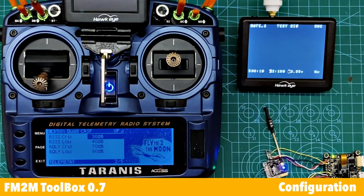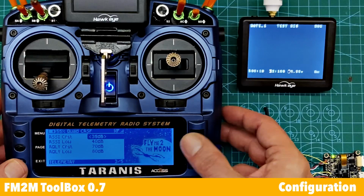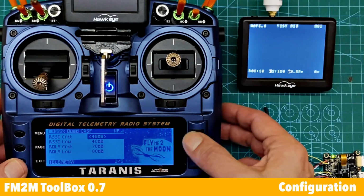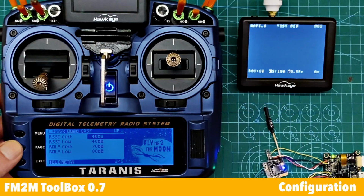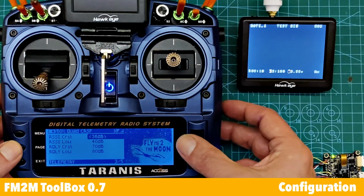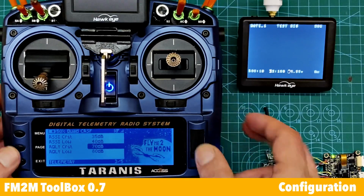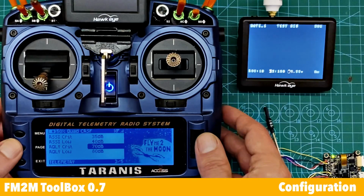All right, next page. This is for RC link indicators. So again, critical and low, depending on the RC link sensor you use to check your RC link quality. Nothing much here, I think. Just set appropriate values. I think for RSSI with FrSky it's like 35, while for Crossfire RQly should be like 70 and 80 for critical and low.